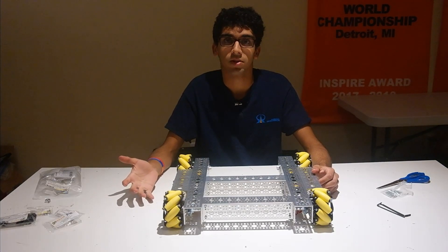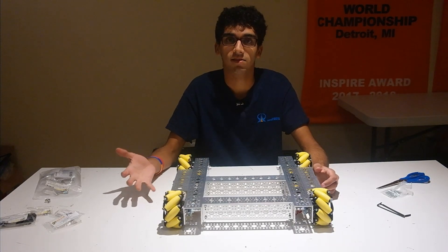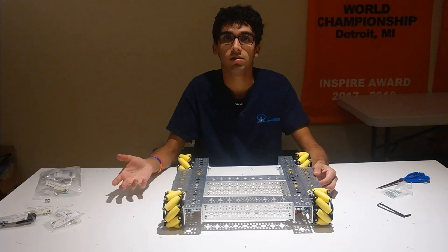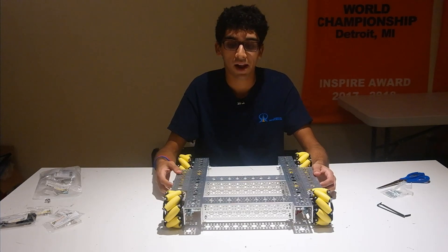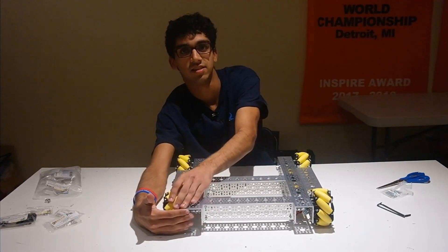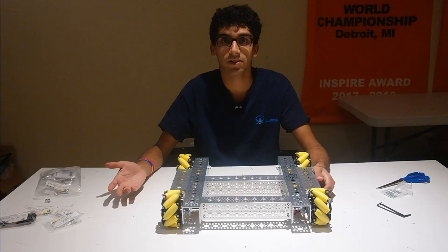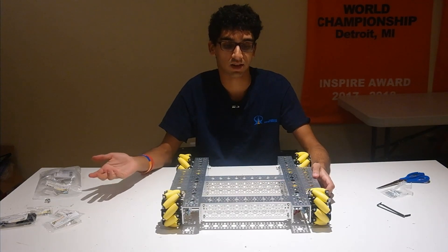So what is odometry? Odometry is a way that we are able to keep track of our robot position independent of the motors. FTC teams typically use the built-in motor encoders to keep track of where their drivetrain is. But what if their robot is against a wall and their motors are running, their wheels are spinning, but the robot isn't actually moving? The robot wouldn't know exactly where it is on the field, and that prevents it from being accurate in its motions during autonomous or teleop.